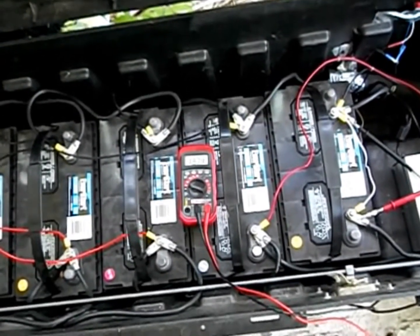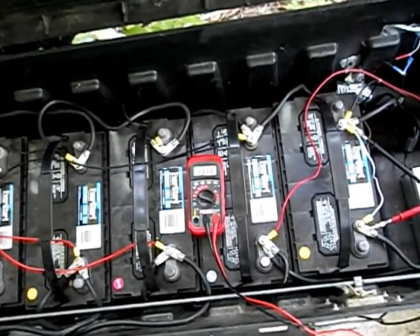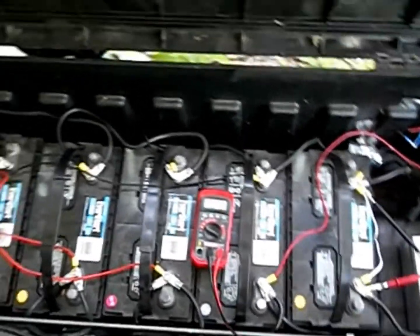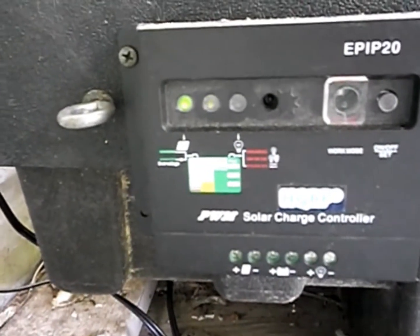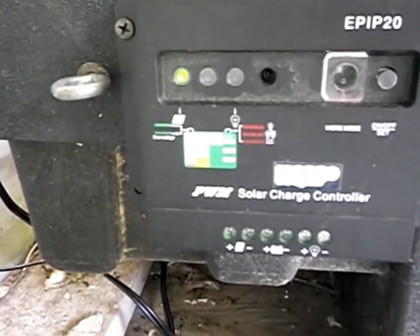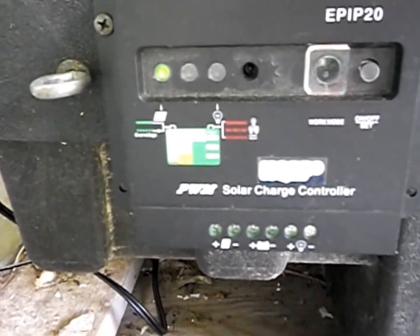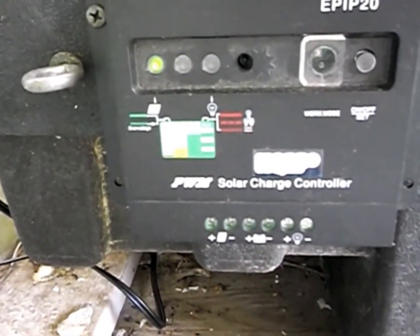That's going to take me down to eight panels installed. I believe I had 13, I took away one — that was 12 — and now I'm going to take away four, so I'm going to have eight panels. We'll see if I can keep up with producing enough power and keep from overcharging, because this right here is danger. It's actually saying it's not charging anymore — it's saying it's not going to send any more power to the batteries because they have too much.